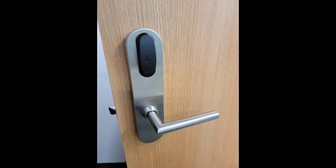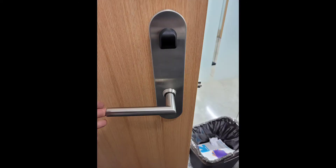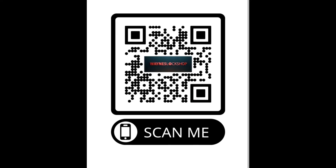After pulling apart the lock, it seemed that the housing was in a bind due to improper installation. Once we opened up one of the mounting holes and removed the bind, the lock began to work and function properly. However, we definitely still recommend replacement on this, because we don't want problems in the future — it puts added strain on those parts and the spindle.